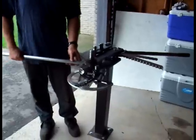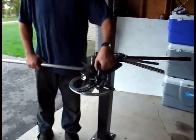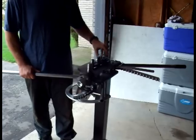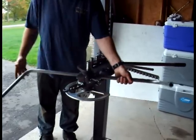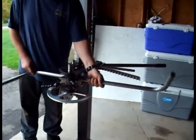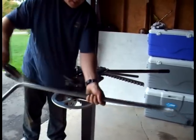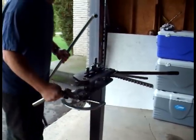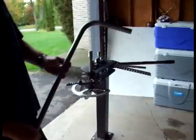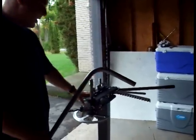And then we just give the tube a bit of a wiggle to loosen it up, make sure the tension is off the tensioner bolt, remove the U-strap pin and the U-strap itself, and then remove the tube from the bender. You can see that if you've got a complex shape, as I happen to have 2 ends bent in this, it's probably useful to remove the die and just slide the tube out. With that done, we now have our nice 90-degree bend made in our 1-inch tube using the JMR 3-speed manual tube bender.